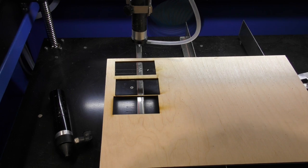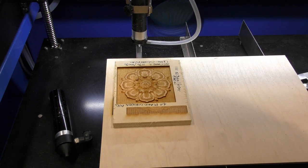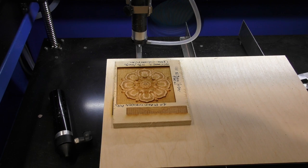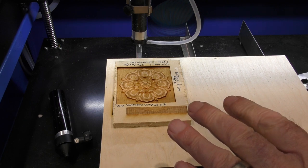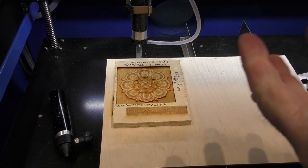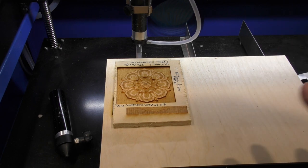In effect, what they're doing is 3D engraving with a non-special bitmap. You need a special bitmap to do proper 3D engraving like this. And so you'll have to go and look on the old interweb. If you go and look up 3D bitmaps or 3D CNC bitmaps, just Google something like that. You'll find all these strange, waxy looking images, black and white. Wax is about the best way that I can describe it. As soon as you see one, you'll know what I mean.